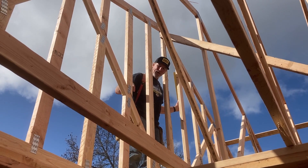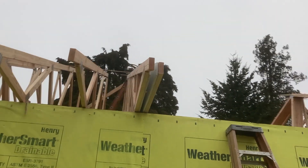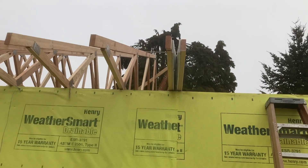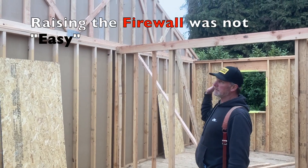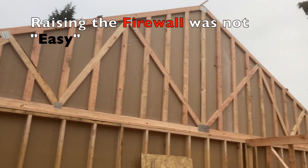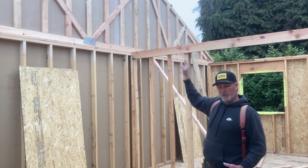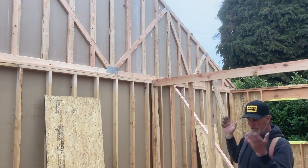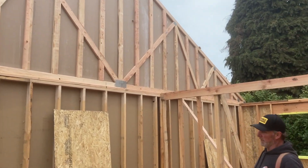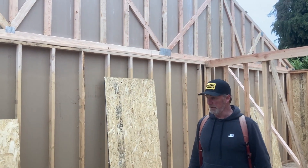Two trusses right next to each other with sheetrock on the inside and an inch-and-a-quarter air gap — a couple-inch gap between each side of the firewall — to give it air space if fire tried to go through both walls. We raised this with the sheetrock already on the gable laying flat, which was pretty heavy and a long ways up. We put a clevis on the other gable as a safety measure, ran a rope through as a backup, and the three of us shoved it up with boards to get longer boards underneath. Maybe not the smartest way, but it got done and nobody got hurt.